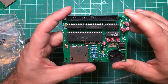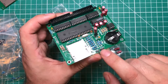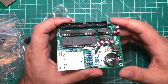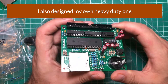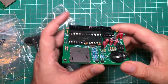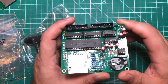You also have a couple of options depending on what kind of enclosure you want. Some boards have the LEDs soldered directly on; others have little headers so you can run them remotely. It just takes five volts and ground. There are some cool enclosures on Thingiverse that I'll link to. Basically you put the board in, attach a ribbon cable — I made mine myself — and use a boot disc. You could also update the ROM so it boots automatically, but I use a boot disc. I'm using a GoTek, and all of a sudden you've got six hard drives on your Model 4.